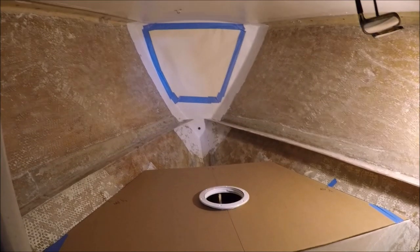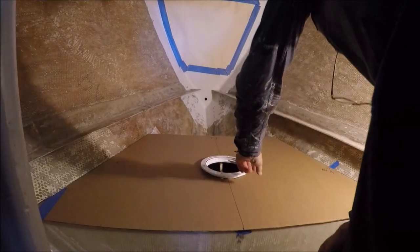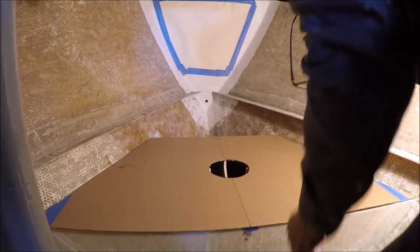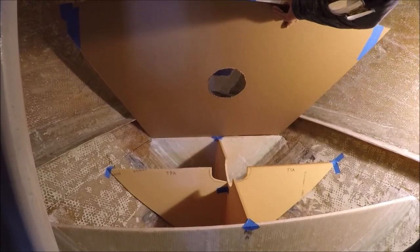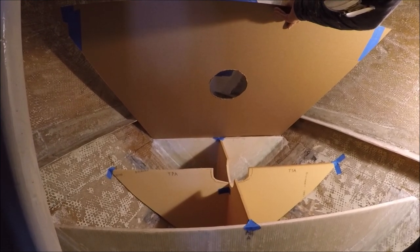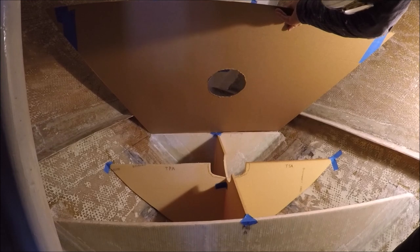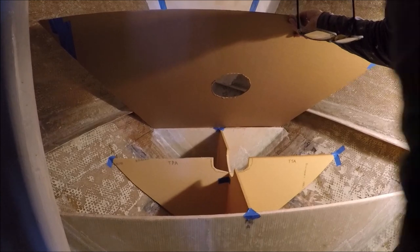The cutting pattern for the top of the tank is made out of cardboard, and I check that I can reach inside all four corners with the inspection plate. The baffles are already cut and ready for fiberglassing — those are three-eighths inch Divinycell instead of the half-inch used for the outside. There's a center cut-down so you can get your hand in there.